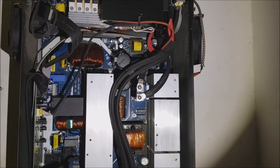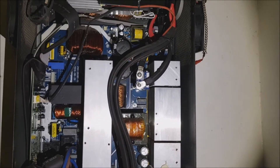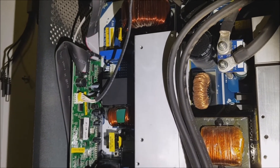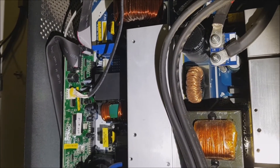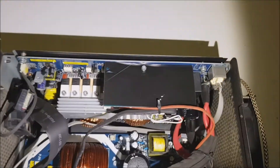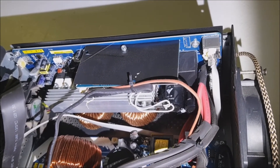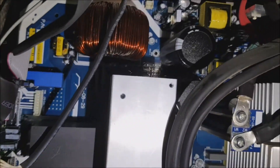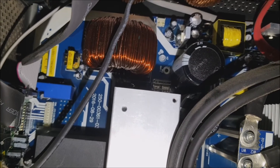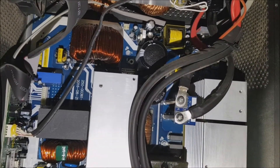In the meantime I have opened the inverter just for a visual inspection. The main part in the back, this PCB, is the DC and AC main board - there's all the power electronics on this one. And here on the side, that PCB is the controller unit - the processor and all the logic for the inverter and the display. And here on top, that is the MPPT charge controller, in my case an 80 amp version. Interestingly, I found the date of manufacturing: 2016 September, so this is already quite an old inverter.